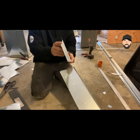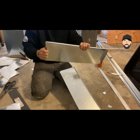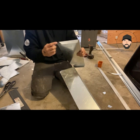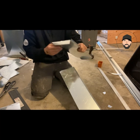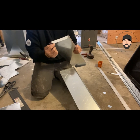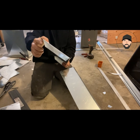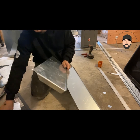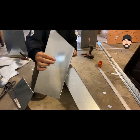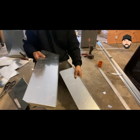So when you do your notches here, you have to do a half inch on the bottom, 1 inch on the side, which allows you to do the fold. On the opposite side, on 7 3/4 across from that, you're going to want a full 1 inch notch. But when you do your 1 inch notch on this transitioning piece, you're not going to want to just make a square notch. You're going to want this one to be a little angled. That way, when you put your piece like that, if this was squared, it would hit the other piece of the transition, instead of being able to really sit with it. So this piece would hang over and it would kind of stop you and you'd be fighting that corner there.